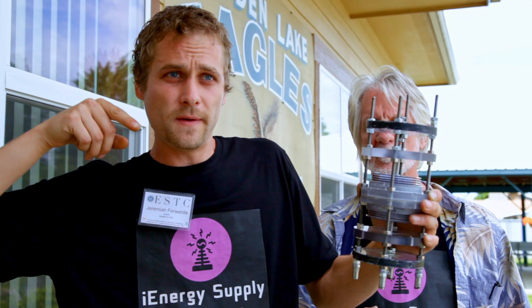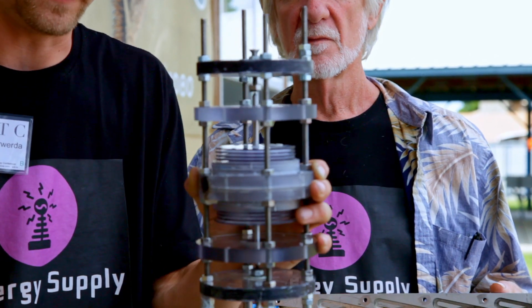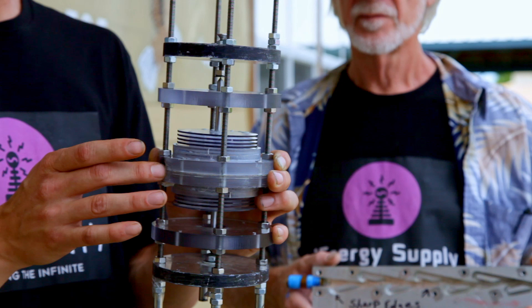That's one of the reasons Tesla uses his discs — because if you've got a fin and those particles hit that fin, they're going to be forced in random directions and that's going to cause a bunch of turbulence. So he uses the principle of viscosity, the dragging effect, instead of the impact effect that a normal turbine will have. It's a laminar flow that you want to achieve inside the turbine, and in order to create that perfect laminar flow, you need the back pressure reduced from 14 pounds all the way down to about one pound, which increases the efficiency from 50 to 100%.